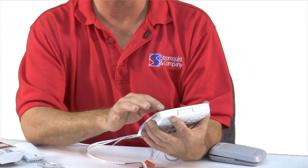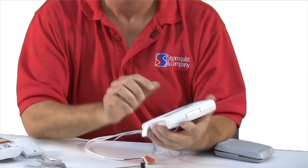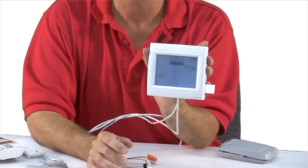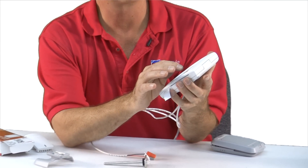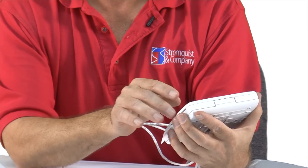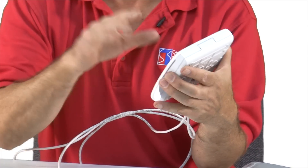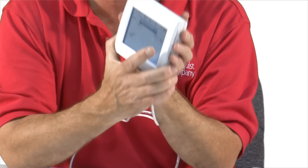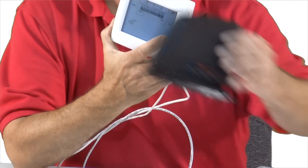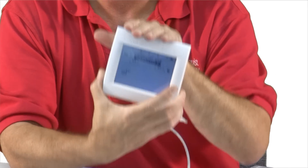The first thing it's asking is the application — is it residential or is it commercial? I'm going to select commercial. You arrow up and arrow down to select the mode. The next question is thermostat name. If you have multiple thermostats, you can name each one so you can differentiate where it's at. That's extremely helpful if you put these on the internet through the gateway, and one gateway will talk to four thermostat devices.